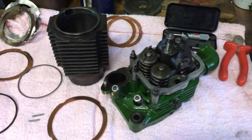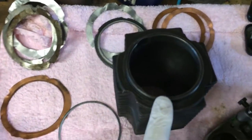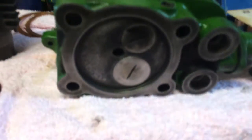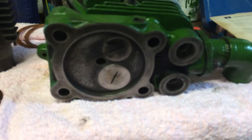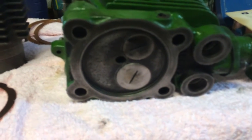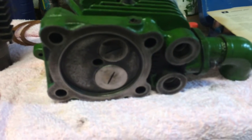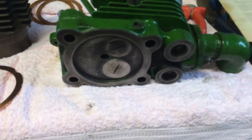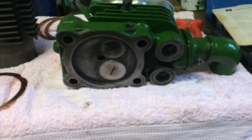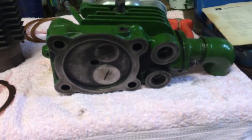Your bump clearances are the clearance between the top of the piston when it's at top dead centre and the bottom side of the cylinder head. In these diesel engines you've got very, very tight tolerances — you're talking about a few thousandths of an inch. This is all about getting your compression up as high as possible so that the mixture will explode as it's heated to a great temperature as the piston compresses the air, and the minute drop of diesel is then sprayed in by the injector. So these clearances are quite important to get right.